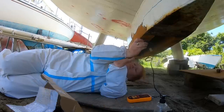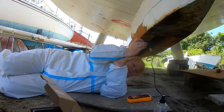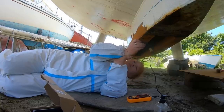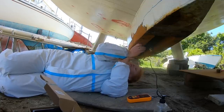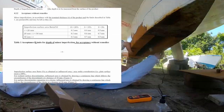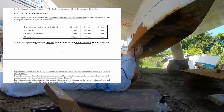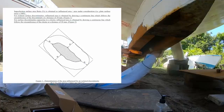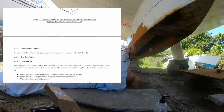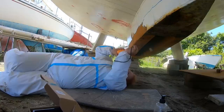I'm off to crawl around under the boat and do some thickness testing on the underside of the keel to see what we're left with after shot blasting. Melissa is using a device called an ultrasonic metal thickness tester to measure the thickness of the steel after blasting. This is so that any repairs below and above the waterline can be done in accordance with shipbuilding and repair quality standards. This enables us to accurately identify which areas are within acceptable limits and isolate areas in need of more thorough repair. Working to these guidelines clearly lays out definitions of areas of imperfection based on the ratio of thickness and area, giving us clear guidance on how those imperfections should be remedied.